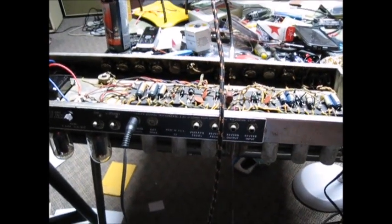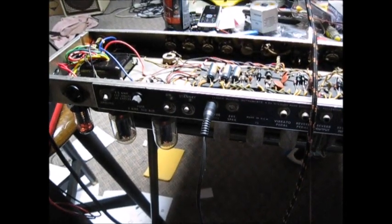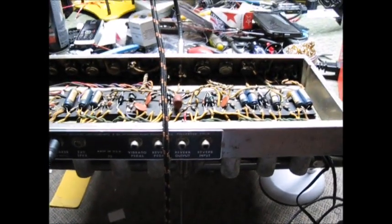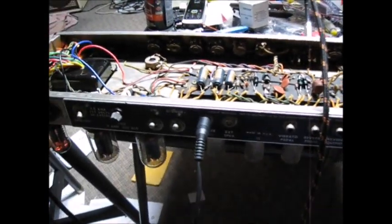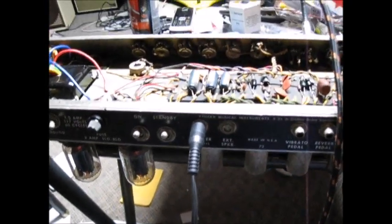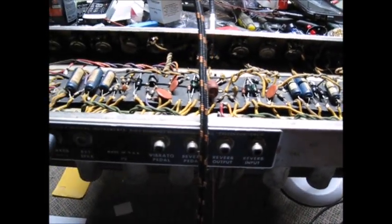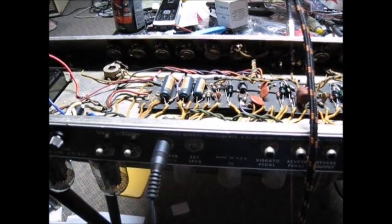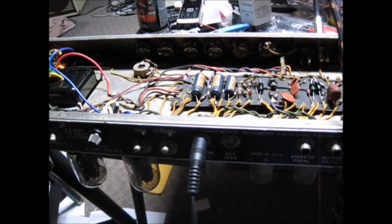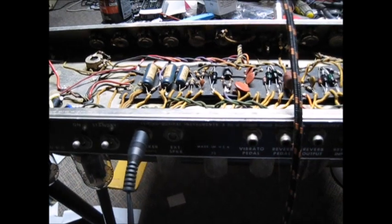We've been able to sound check it - it's plenty loud, plenty clear, it's quiet, sounds okay to me. Everything looks normal, we're running all the correct voltages, the bias is set according to what Fender likes, and none of our tubes make ringy-dingy noises anymore. At this point we just need to let the customer evaluate what it sounds like and see if he thinks it sounds like a Fender now. It does to me - and I don't know technically what a Fender sounds like, he says facetiously. From model to model everybody has a sound in their head, but we're working.